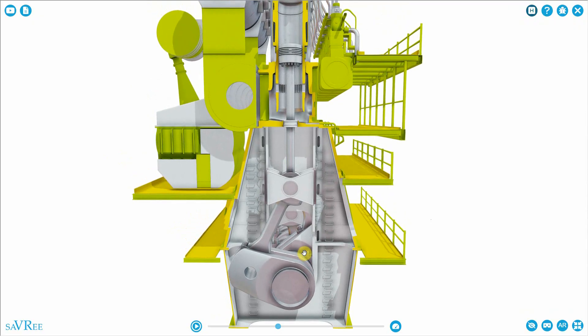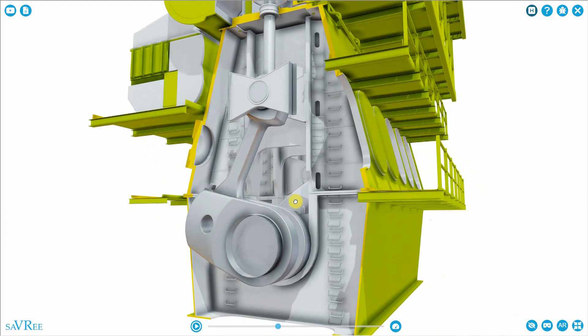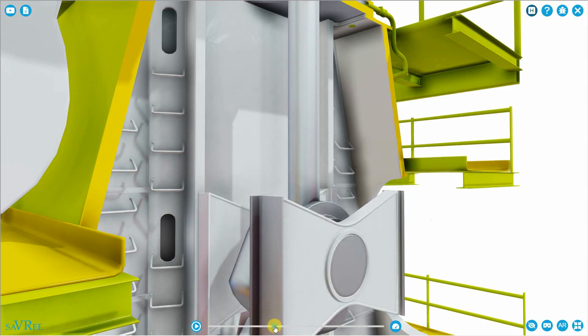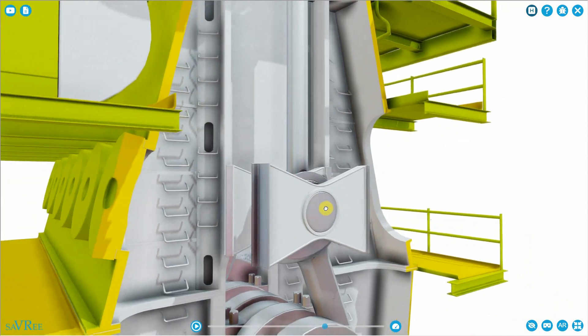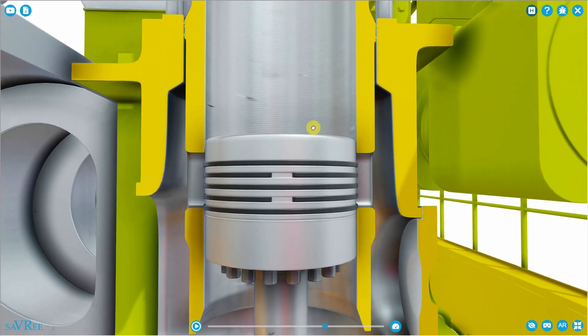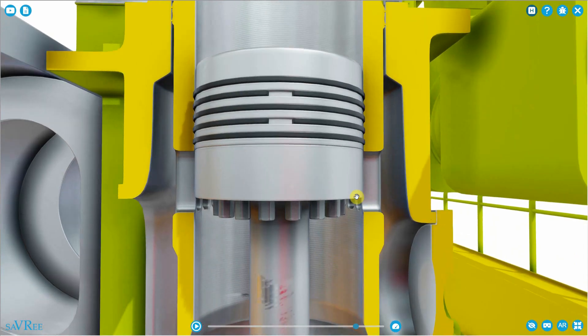It would be difficult to manufacture components that could withstand that kind of pressure. We would also require a larger, wider crankcase, which might make it a little uneconomical. To remove these problems, we install a crosshead. The crosshead runs up and down some guides, and we ensure that our piston rod remains in alignment with the cylinder. That is, in fact, another big benefit of this design, so that the piston rings seal effectively against the cylinder.